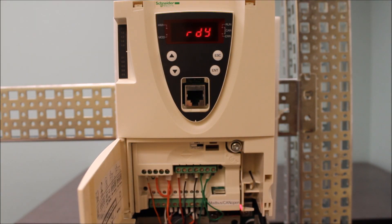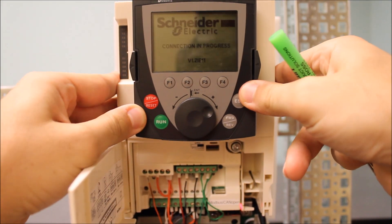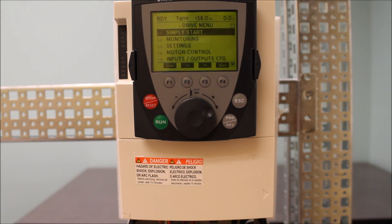If for some reason the 24-volt or the 10-volt is missing, or if this built-in display is blank, this might be a drive issue — it could be a power board or a control board. At that point, I would recommend calling us to see what the main problem could be. This keypad does work — just click it on right there and it should power up without any problems. This is basically what you can do to confirm what's causing your blank display on power-up of an ATV-61 or ATV-71 drive.